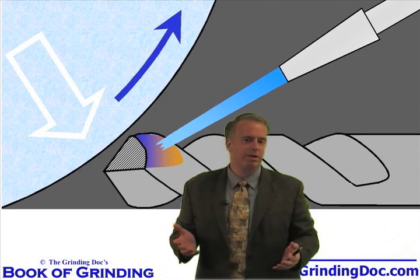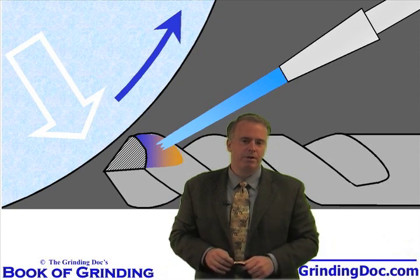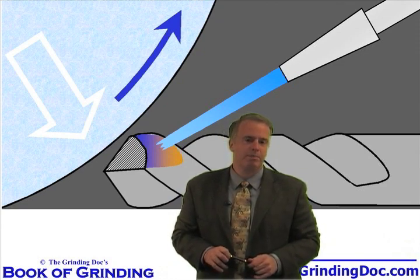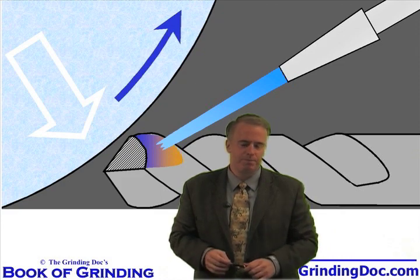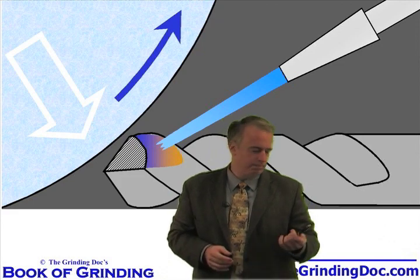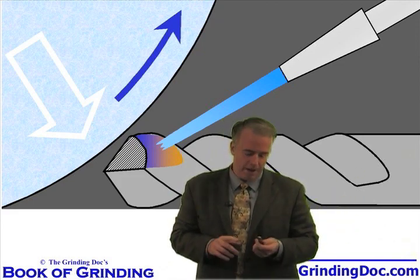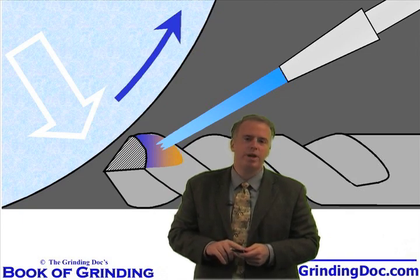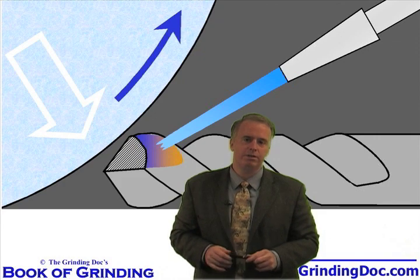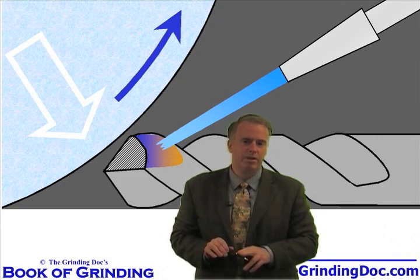What's the difference between oxidation burn and genuine thermal damage? That's a big subject because there are a lot of different types of thermal damage depending on what temperature you reach. Oxidation burn is just rust. You take a chunk of metal out of your car, leave it in the rain for a few days, you come back and it's a reddish color because the iron in the steel is combining with oxygen in the atmosphere, getting that thin layer of rust.